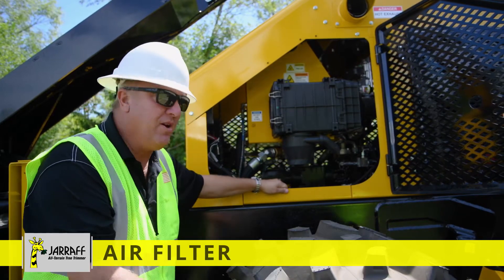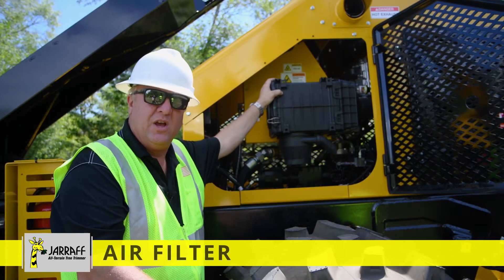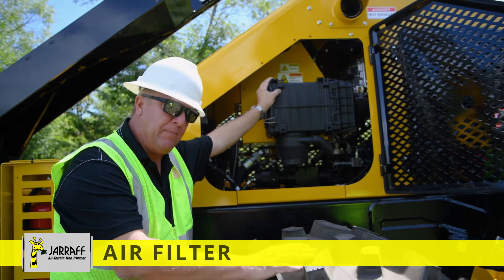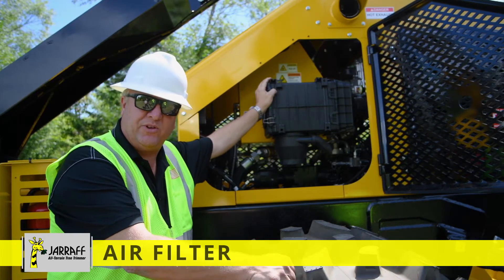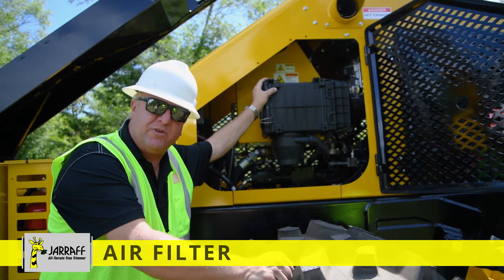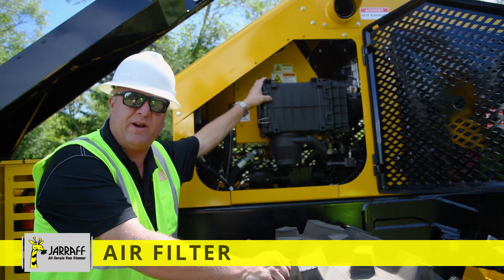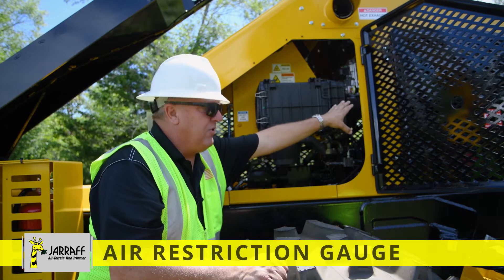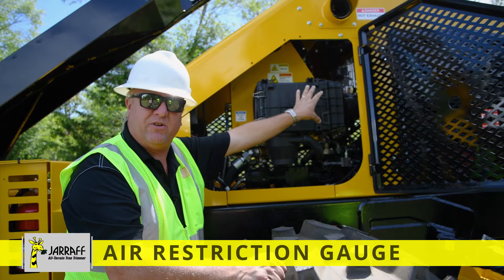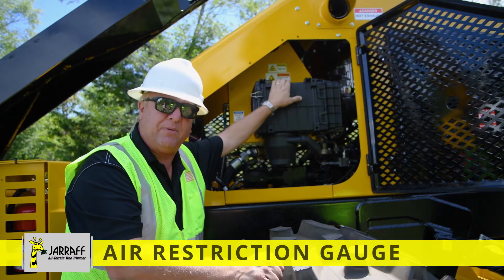Here on the right rear engine compartment door on the giraffe, we've got some key components to talk about. Right off the bat is the air filter for this Cummins engine. This unit has two air filters. First, the outer air filter — you're able to remove it, clean it, and bump out the debris, but whatever you do, don't use an air compressor to blow it out; we don't recommend that because you could blow holes in it. The inner air filter: Cummins recommends that if you remove it, replace it with a new one — do not reuse the inner air filter. In the front of the air filter box you'll notice an indicator, a restrictor gauge. As the filter stops up, that gauge fills up with yellow by percentage — when you're getting up into the 75%, it's time to pull it out and clean or replace the air filters.